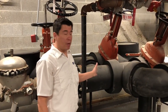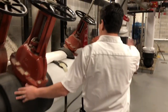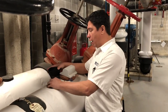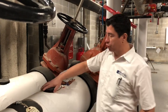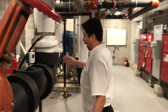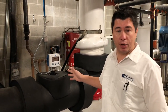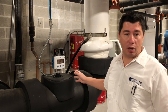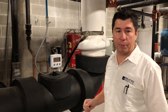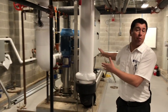Let's talk about your domestic water lines. As the water comes in from the city, you're just going to start traveling through. You'll obviously have a couple of water meters — that just tells you how much you're using. Because this is a newer building, I have an electronic meter. This meter is connected to my building automation system and it can tell me from my computer exactly how many gallons are being used. From here, the next step is your main booster pumps.